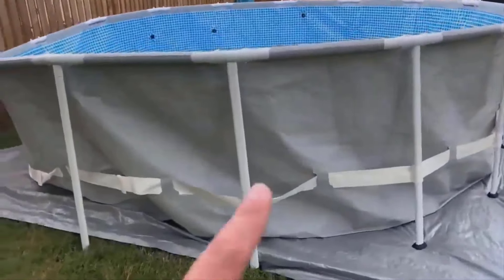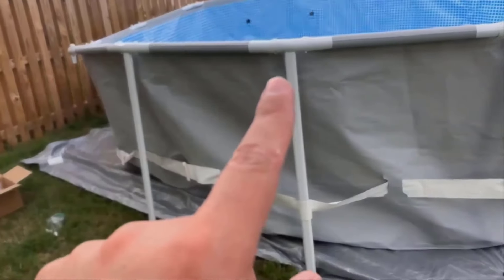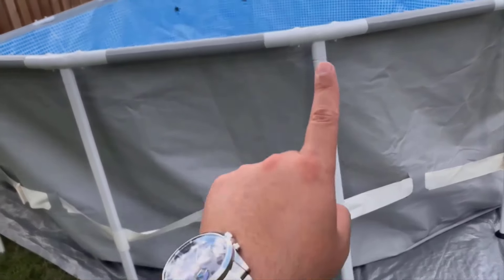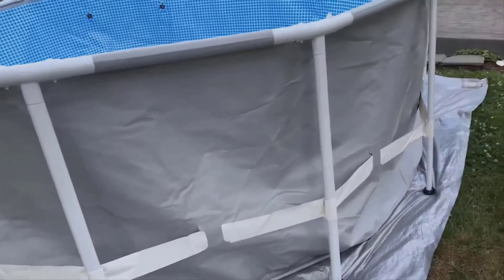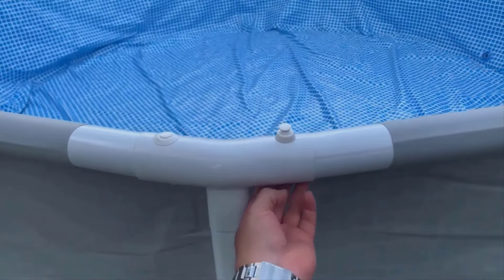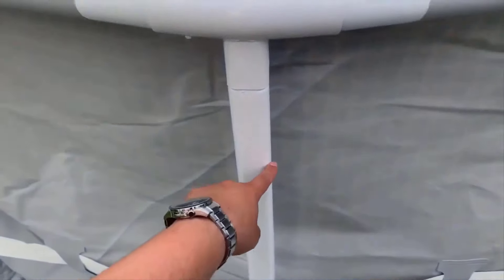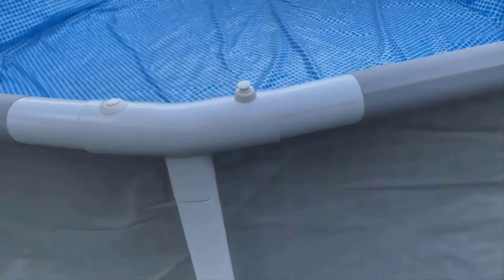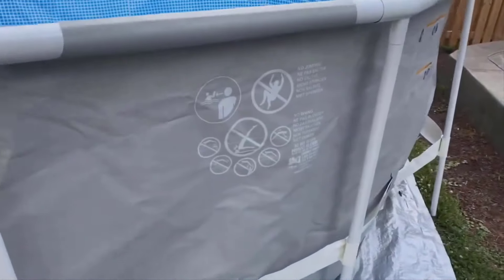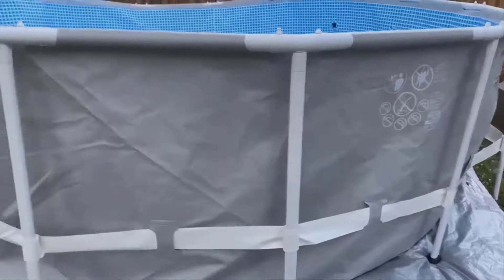Another update: I finished putting all the top beam pins with the T connectors, and I've put most of the vertical posts in. They go through that little loop and lock up with the T connector. A tip: don't push the pin through at the bottom before you put the vertical beams in, because while they're on the ground it's hard to do. Once they're raised up, it's a lot easier to figure out where the pin comes through. I did that on all of them — once all the vertical beams are up, I'll push those pins through.